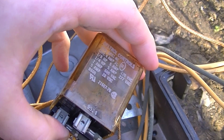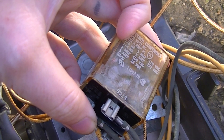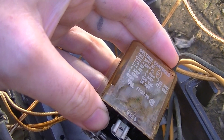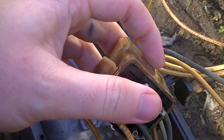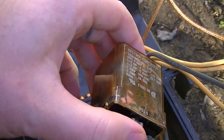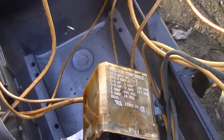What that lamp current does is cause the coil in this relay to pull in. Then should the lamp ever extinguish for whatever reason, the coil drops out, and when the circuit is re-energized — after much less time than it would take for the lamp to cool down enough for the arc to re-strike — this relay, having dropped out, will energize an auxiliary lamp so the fixture is producing enough light for people to see until the arc re-strikes again.